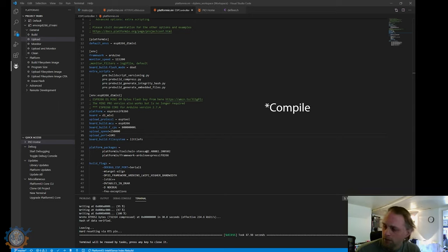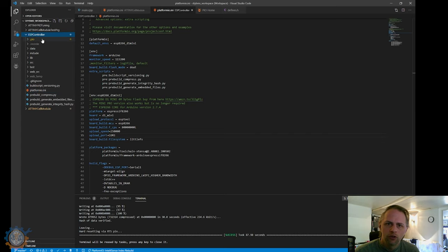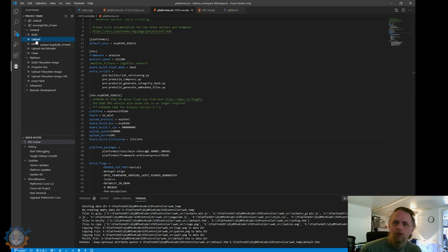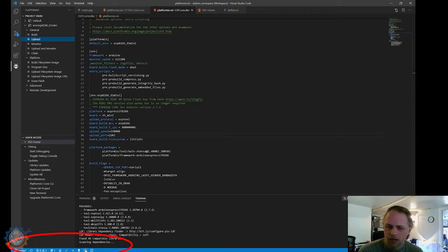The next part is to burn and install the firmware on the ESP controller itself. In my case I'm using the Wemos Mini — as you can see I have it hooked up here. You then go to the project tasks and choose the ESP controller. I recommend pressing on the PlatformIO alien icon. Depending on whether it shows a question mark or a clock, you may have to wait before everything is rendered. When done, press it and you will get the project task ENV ESP8266-D1 Mini. You can build first or press upload directly, since upload also builds. Let's do that and see what happens. Check the bottom link that I may have missed showing earlier. It compiles everything with a couple of warnings — those are fine.